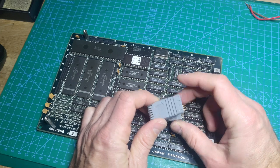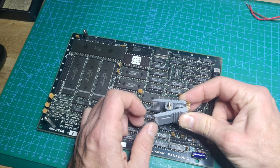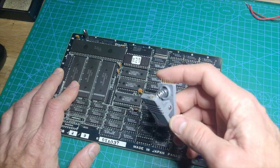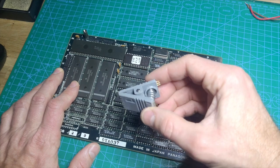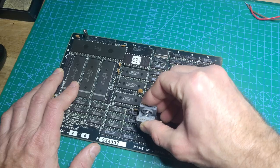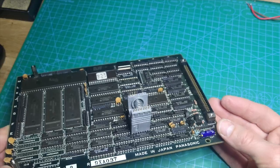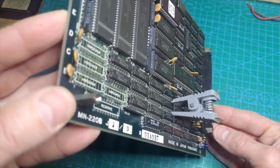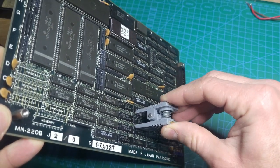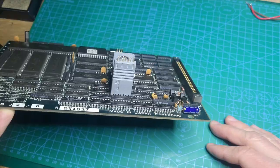Second clip project — I did only partial assembly of it, but it's enough to test it. This is a two-part print with a metal spring to provide the clip with tension. For contacts, the author recommended gold-plated jewelry pins called flathead pins. I was not able to find them at first, so I used gold-plated wire. This wire is not ideal — it's too stiff and a bit too thin — but it works. This clip is self-centering, has plastic dividers between contacts, and will not short the IC pins under any circumstances.